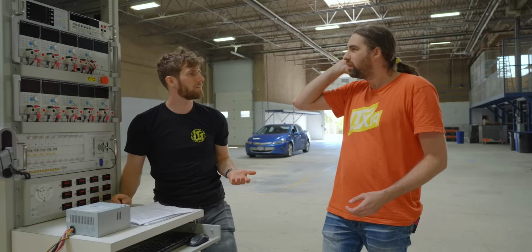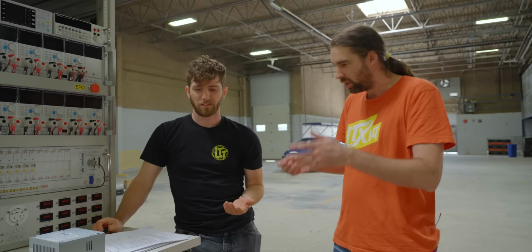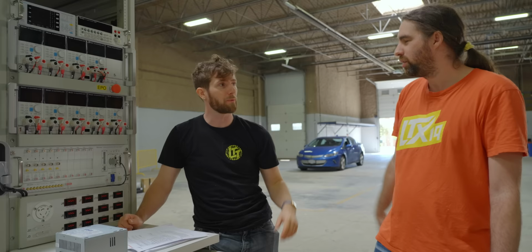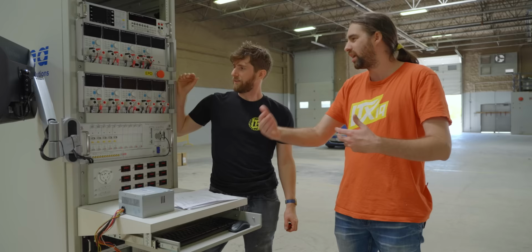No, but think about it this way. If someone's complaining about a certain power supply blowing up under certain architecture, you can build that architecture, get the power supply, put the power supply down, and monitor the voltages as it's happening. And then we could create a simulated load based on what we monitored and find out if anything will blow up. You hired a guy to automate GPU testing. Just get him to get a script that cranks it to like 150% and just sends it. As we get more experience using this, I'm assuming we're gonna come up with our own stuff.